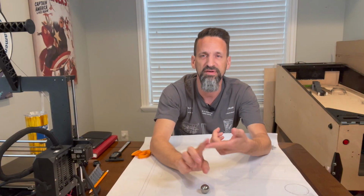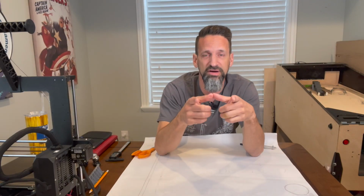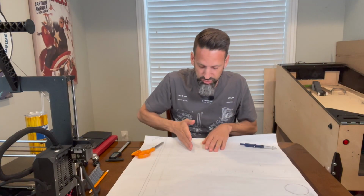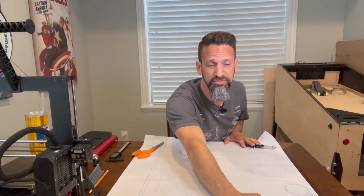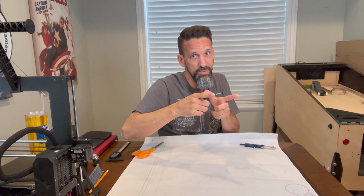Most shots, like I said, are 40 to 50 millimeters wide. Ramps are usually even wider, we're talking like 50 to 80 millimeters, 2 to 3 inches wide. Part of that is also the angle of that shot to the flipper. How is it lined up? If it's straight on from the flipper, it could be more narrow and the ball is going to go straight in. If the shot's more on the side or coming in from an angle, then that entrance is going to be a lot shallower. Even though you might be 2 inches wide here, as soon as you start to turn it, it becomes shallower. You have less of an angle to actually get into it, so you might need to open that up a little bit on a ramp.